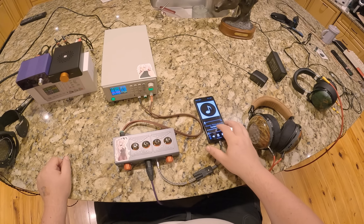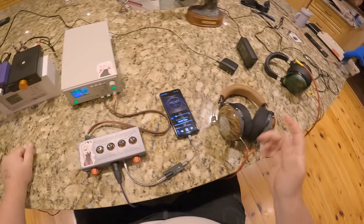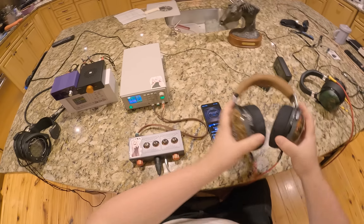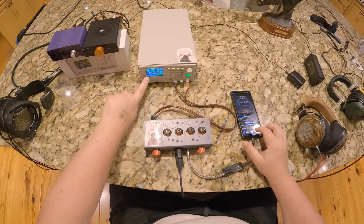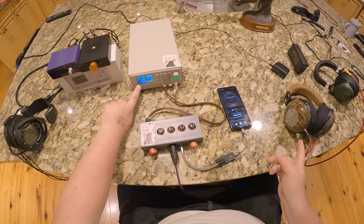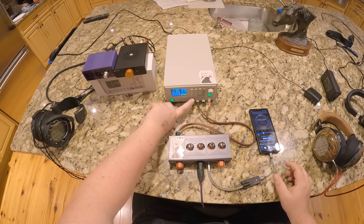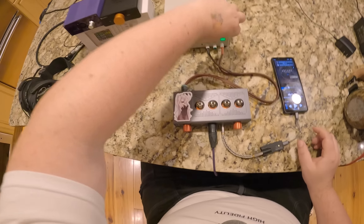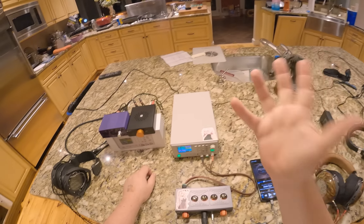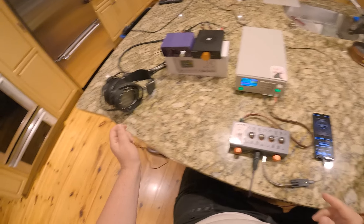The Tungstens, on the other hand, are very voltage-dependent — they run at about one quarter the amperage of the Starry Night V1s. The new open-back Moonlights are much more efficient. One of the things you learn when you start playing with something like this is how hard things actually are to push. When the bass hits we're drawing 12 watts; just sitting still it's 8.19 watts; when the bass is kicking at loud volume it's 13 watts — so that's 5 extra watts to push that headphone.